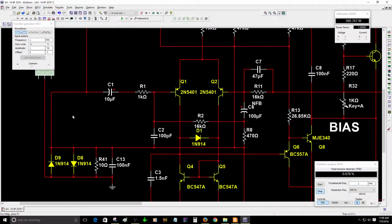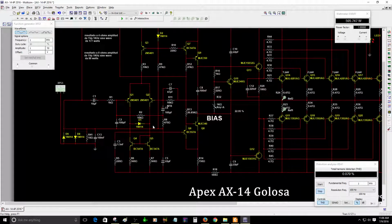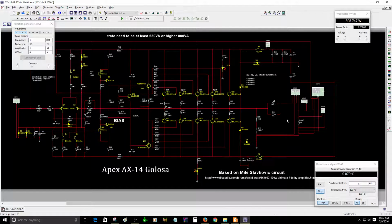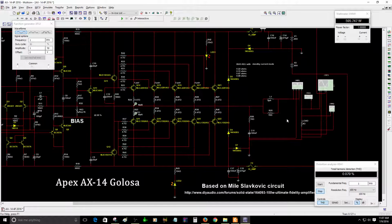Anyway, so you can short out the input. You will remember that after you use the light bulb to test the amplifier, you will proceed to continue. You need to remove the light bulb so you can continue and make the bias adjustment.